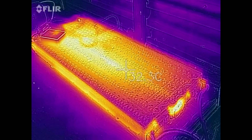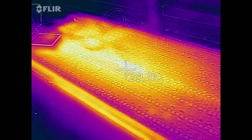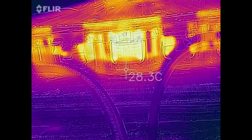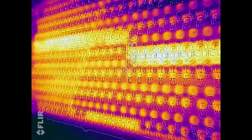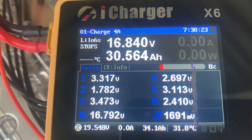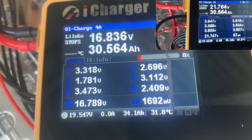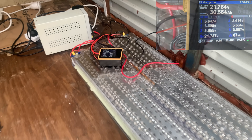Look at that heat — it hasn't been charging for hours. Two hours ago I turned off the water cooling, and all those cells are smoking hot. You lift up the plastic and you get a better look — there are some proper hot cells. Cell one: 3.3 volts. Cell two: 1.7 volts. Compare that to last night's results — that's not looking good at all. We'll let it sit for another couple of hours, then let it discharge so I can dispose of the cell.